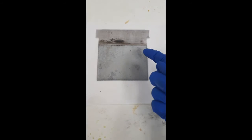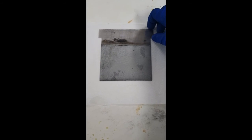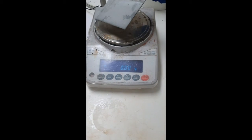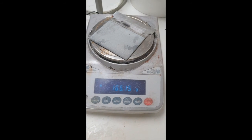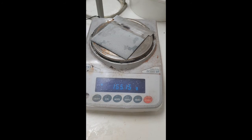All right, so it's the following day now and we have our cathode pretty evenly plated with zinc. You can take some notes on the morphology of the final deposit. So now we're going to measure the final mass of the cathode, and although it doesn't look like much, the cathode now weighs 165.1 grams, meaning that we've plated about 9 grams of zinc.